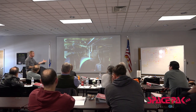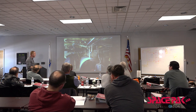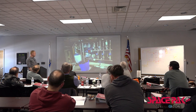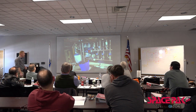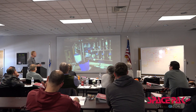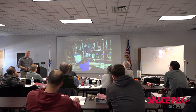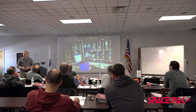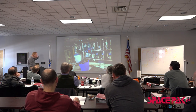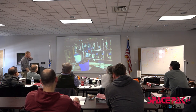So in this application, this is just a 4-pipe buffer tank that was set on its side. Unfortunately, destined for failure. There was a system that he had panel radiators all over the house. Never gets hot, never gets hot. Well, we don't have enough flow, because even some of those panel radiators, large ones, need flow. They need GPM. The circulator that they had, it's not enough. It's not going to cut the mustard.